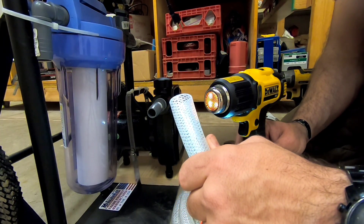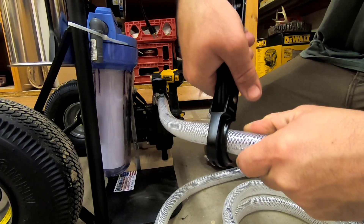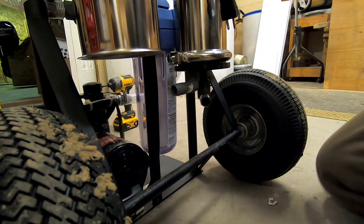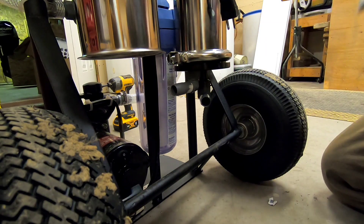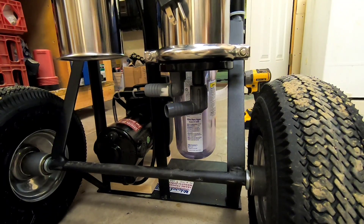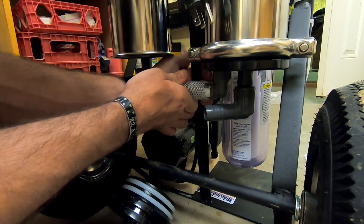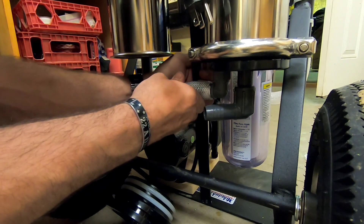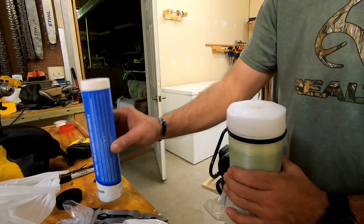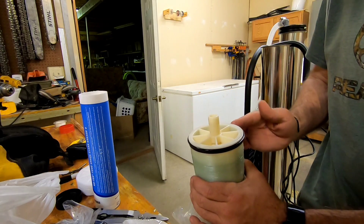The use of a heat gun will help to soften the plastic and make it go on quite a bit easier and help create a better seal — a little pro tip for you. After we've got the lower plumbing on the front side done, now it's time to start doing the rear lower plumbing. Starting with installing the black plastic caps and rings on the membranes. After everything's tight, you're going to want to make sure you install the tubing on the right side canister before you put the lid on the bottom of your left side canister. Otherwise, that tube is going to be almost impossible to get on your elbow. The outer one — your permeate line — it doesn't matter, you can do that after the fact. When you're installing your membranes and even the O-rings on your caps, make sure that you put some food-grade grease. Just a little goes a long way — food-grade grease on those will help aid with installation and sealing. This is a very important step.